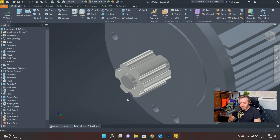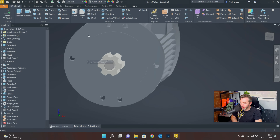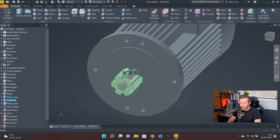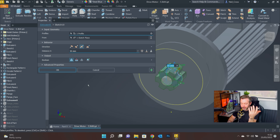For something like this cog — if you need to make a change to the number of cuts on the cog, where is that in the browser tree? You didn't make this model. So if I sent you this and said 'change the number of cuts on that cog to a pattern of 8,' the first thing you'd do is look in the browser tree for a circular pattern. You'd go 'oh, it's not that one,' look for the next circular pattern, and there isn't another one. Is it a hole pattern? Nope. Flange holes? Nope. Where the hell? We've already wasted unnecessary time. So you then have to change your selection to feature priority, pick the feature, right-click, go to edit feature — and that's when you'd realize the whole thing is one extrusion, which would leave you scratching your head thinking 'who's done this, why is it all as one extrusion?'